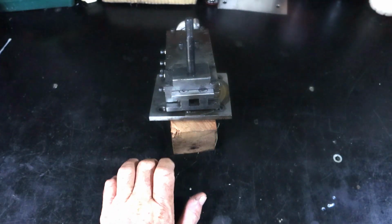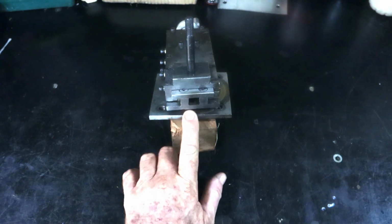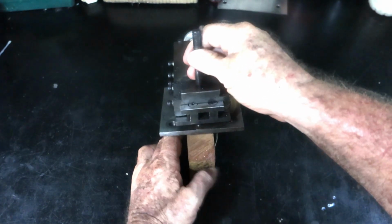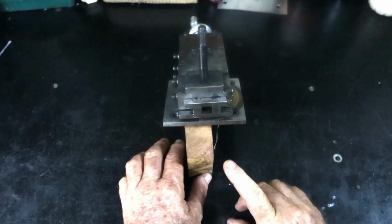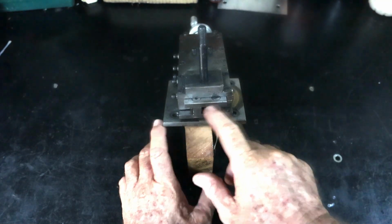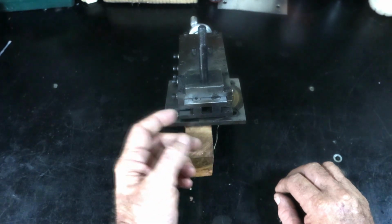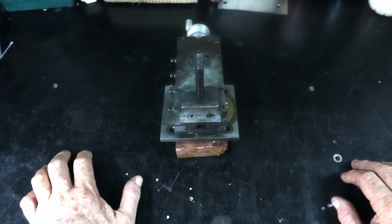Like everything else on that lathe, well except for the main carriage which runs on those pieces of angle iron, the cross slide is set up like this as well, where everything's just flat surfaces. There is a brass gib in here to adjust for this, but in here there are just pieces of aluminium can being used as shims to get all the slop out of it. That worked fine when I first made it, but it's not working fine anymore.